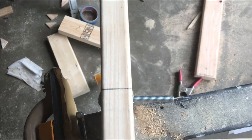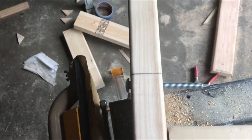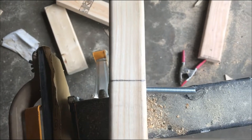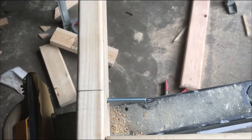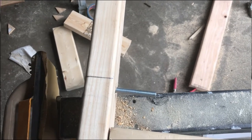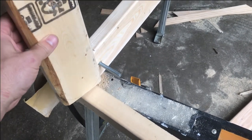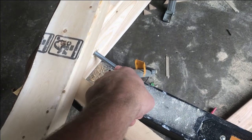We're drilled through. Put the three-eighths-inch, four-inch-long carriage bolt through there — they just stick out a bit on the end, so just hit it with a hammer to get it nice and flush. The carriage bolt is flush in the three-eighths-inch hole. Next step is to get the holes drilled for the legs. On the leg, measure an inch and a quarter down and an inch and a quarter in — that's where we're going to drill to match up with the carriage bolt.